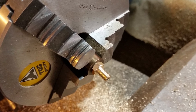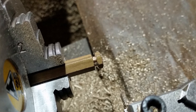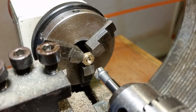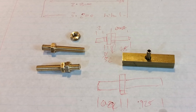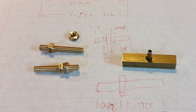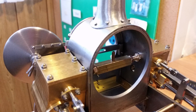The hex has been chamfered and the job drilled right through 1.5mm. One of two locking nuts for the inlet — 1/8 inch thick, chamfered both sides with a round nose undercutting tool, drilled and tapped 3/16ths by 40 TPI as well. Second operation on the nut in the Unimat: face to length and chamfer the thread. Here are the steam inlet component parts — there's the 5/16ths inch square body with 1/8 inch tubing being loctited in. The body is tapped all the way to the middle from both ends. The external threaded pieces screw right in so I can get the assembly into the smokebox, and then unscrew each side into the cylinder's steam inlet ports. It's in position, ready for testing — definitely a boiler-out job.